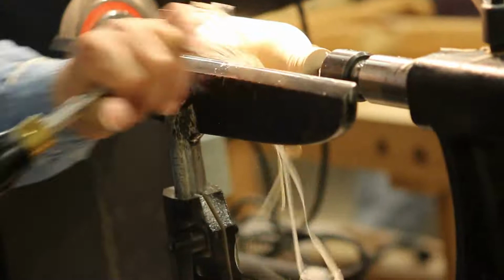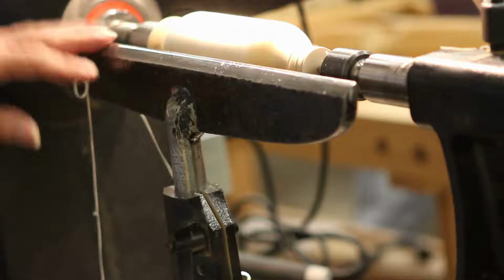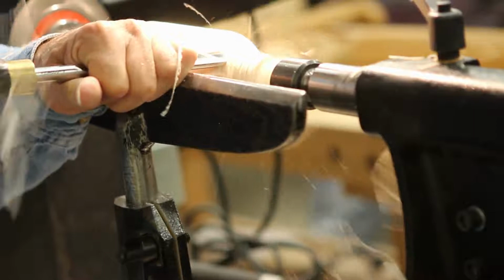And again, your small diameter should be about half of your full diameter. Resist the temptation to go deeper each time, because if you do that, eventually you're going to get so thin over here that you're going to start to experience workpiece vibration, and you have enough problems that you don't need to have that one additional problem. But notice how this starts out just like a ball, but then when you get about halfway down, you kind of reverse the process, and it becomes a concave curve.